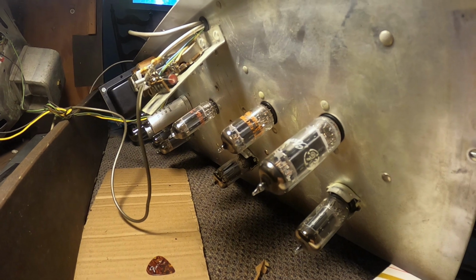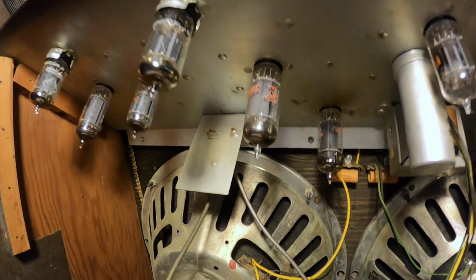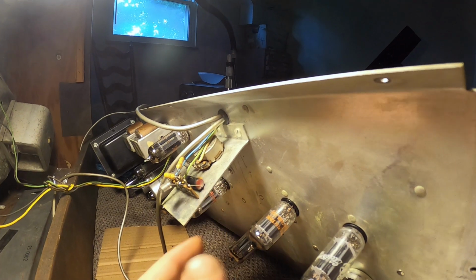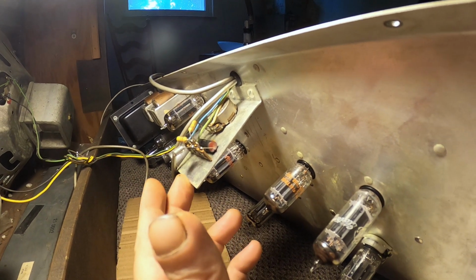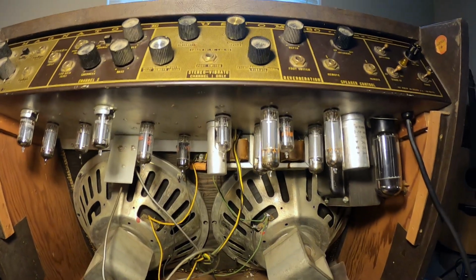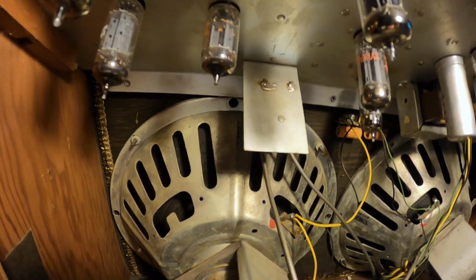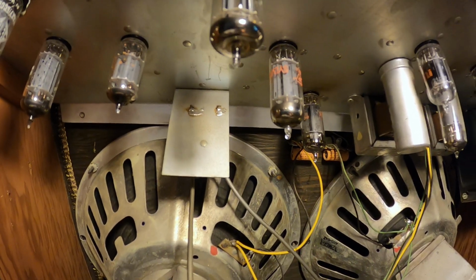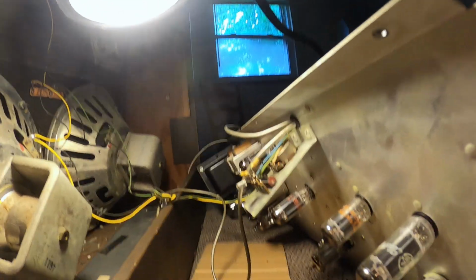Again, if you're looking at the front of the amplifier, all you see is this little aluminum plate right here. Looking from the back here with it out of the chassis, you see that little potentiometer. So be sure and check that. If this amplifier has been sitting for a while, there's a chance it definitely might not be passing a signal through, and if it's not, then one channel will be out. So as far as I can tell, unless mine's been modified at some time, that's what's going on with this Magnatone 480, which dates to around 1963, I believe.